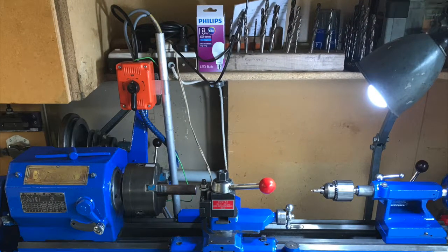We also need to think about safety — specifically these wires getting damaged by pieces of metal flying off the chuck. In this image you can see I fixed a vertical pipe for the wires to run through, and there's a piece of plastic hose inside that pipe to make sure the cables don't get chafed.